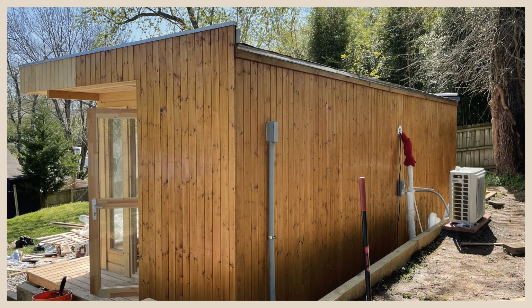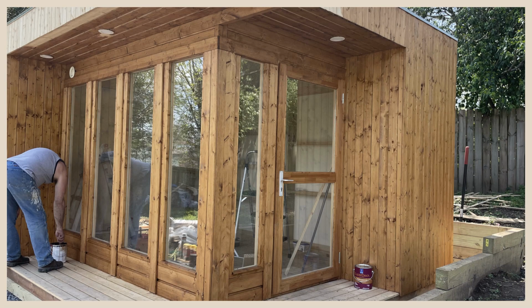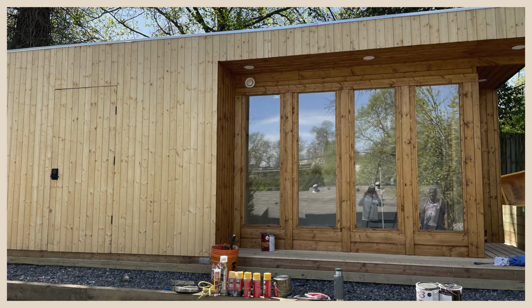We brought in a piece of wood and had them do a little test on that piece of wood without making us buy it. But there's really just no way to know how it's going to impact the actual wood as a whole on this large of a surface. So all in all, I would say that the building at the moment is a little bit too saturated for me. But here's the caveat. With stain, you typically have to go more saturated than you want because the sun is going to dull it and it's going to fade very quickly over time. So for that reason, knowing that it was going to feel very saturated, we ended up going with a full transparent stain.